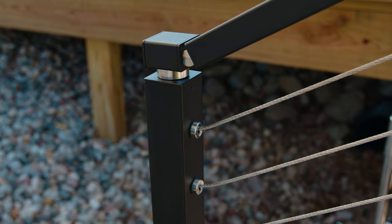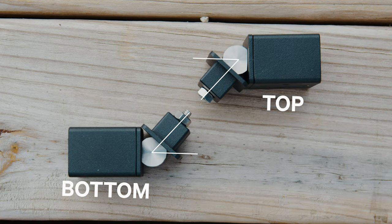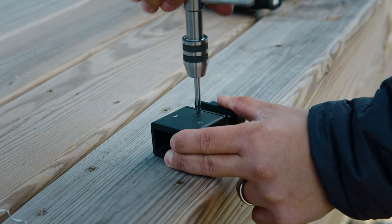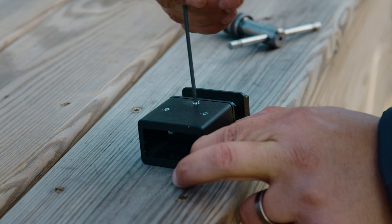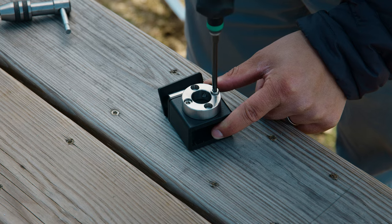For the other end of our stairs, what we do will depend on what we need to do with our handrail. In the most common cases, our handrail would end and we'd construct a stair kick out. The other cases would be our handrail being installed at an inside corner, or our handrail continuing in a straight section over either a 2x2 tensioning post or a line post. To assemble the stair kick out, we'll start by sliding part A of our handrail hinge into the end of the kick out, making sure that it pivots in the correct direction. Now we need to create a pilot hole in the hinge plug by drilling an inch into the non-threaded hole. We'll tap the hole with a 10-24 tap and secure it with a 10-24 by half-inch set screw and 3/32nd Allen wrench. Next, we'll attach the post top collar to our pre-cut handrail section using two handrail mounting screws, driving those into the pre-tapped holes using a 5/32nd Allen wrench.